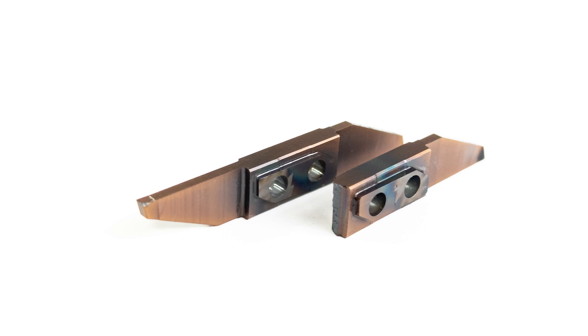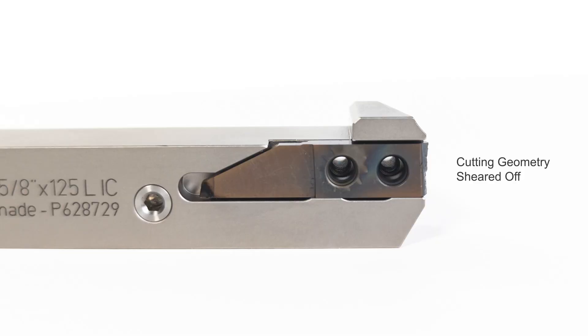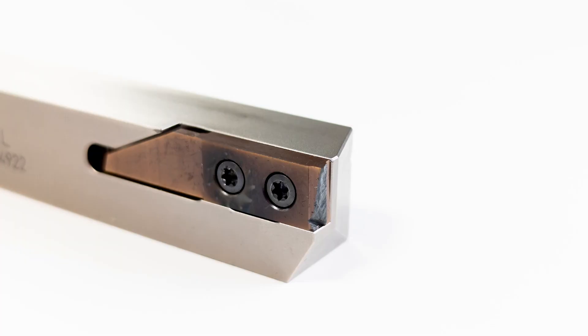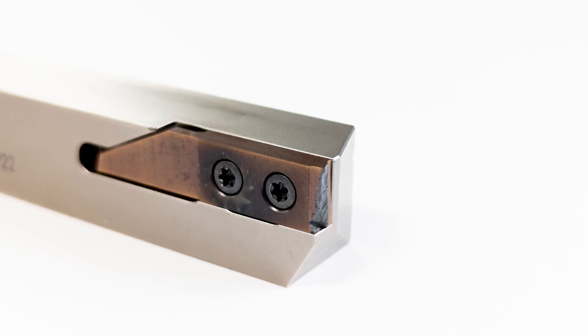Here's a great example: a complete insert with both edges intact, brand new. Here's a primary example of what can happen — you can lose an edge with one of these systems, and yet you won't lose the second edge and you won't lose the holder. Utilizing the design of that insert and how that boss sets in that pocket, if there is a failure — and they will happen — the insert is specifically designed to yield at a place beyond the holder where you'll lose one edge only, protecting the second edge and, more importantly, protecting your holder. As I like to say to customers: if you think losing inserts are expensive, just start replacing holders. That's really one of the key drivers of the Cut 3000 Series — the holders are safe during a failure.